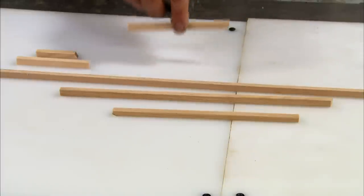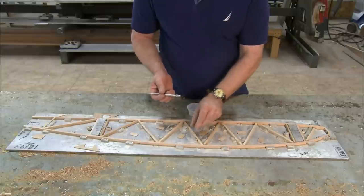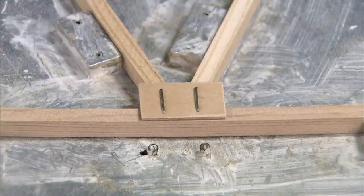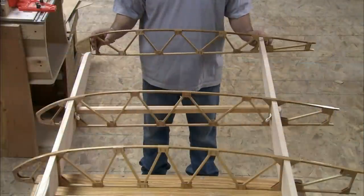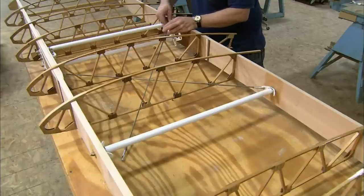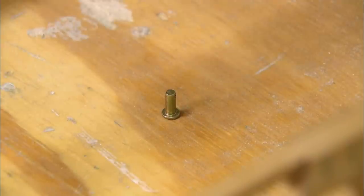The two curved strips are glued together to form the perimeter of one rib. Short diagonal strips called trusses are glued in between. Both sides of each intersection are reinforced with a rectangular piece called a gusset. The 15 ribs are mounted crosswise on the front and rear wing spars. To absorb air load hitting the spars, three aluminium tubes called compression ribs are installed to keep the wooden ribs from flexing under pressure. The compression ribs are connected using criss-crossing metal rods.